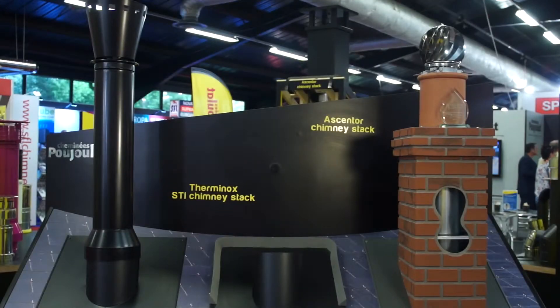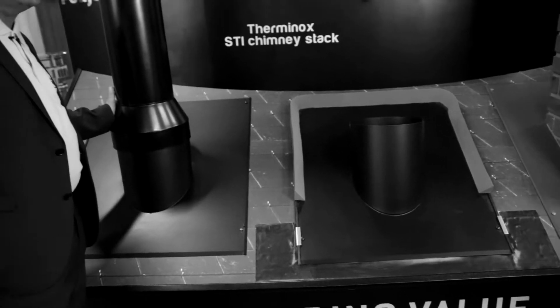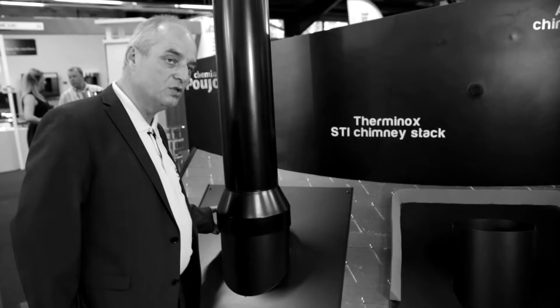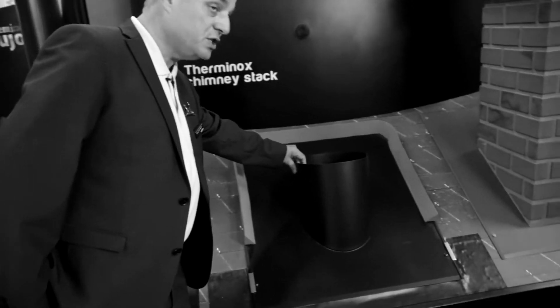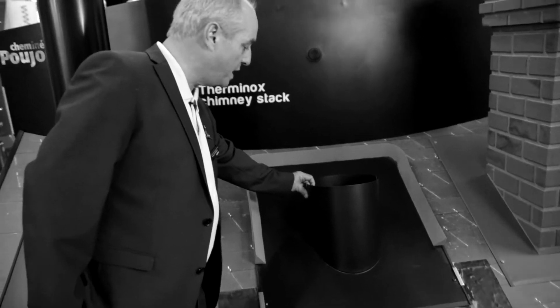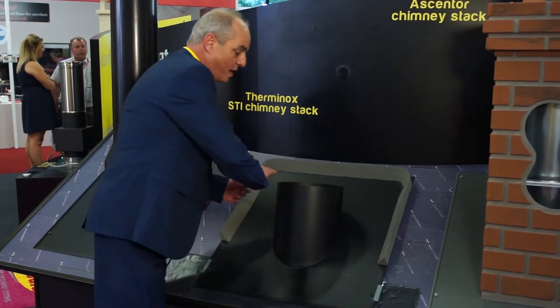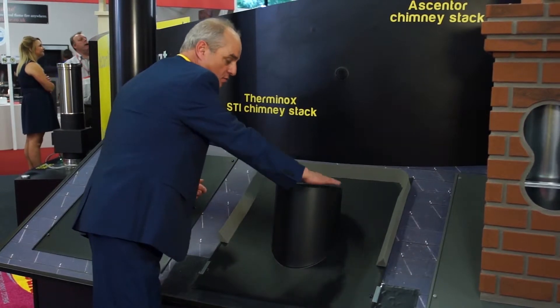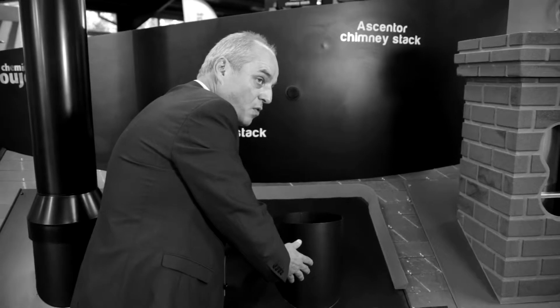One of the evolutions of the Chimney Stack was to make a chimney stack with a flue pipe. We created a welded storm collar, and inside that welded storm collar is a bracket fixing that allows the pipe to fix to a flashing that's fixed to the chimney. The two rods fix into these slots. You have to ensure that this is level left to right, and then install it level front to back, using a rafter support below the roof.